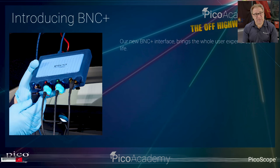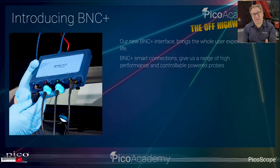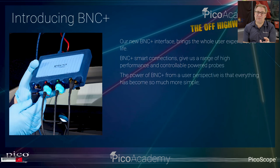BNC Plus is the latest generation of connectivity. So for those of you who've used oscilloscopes before, you'll be fairly familiar with BNC connectors. What we've got with BNC Plus is some additional connectivity with the component. This does a number of things, but more importantly, it gives us power to those components. So previously, we would have had to have batteries in current clamps and things like that. We don't need that anymore. So no longer when you're running parasitic drain measurements do you have to worry about a battery running out. It's just powered directly through from the scope.